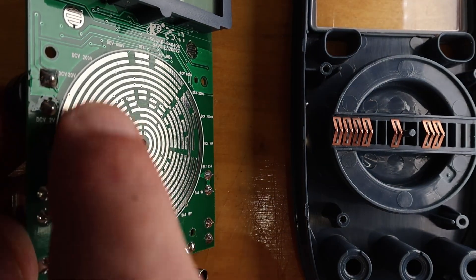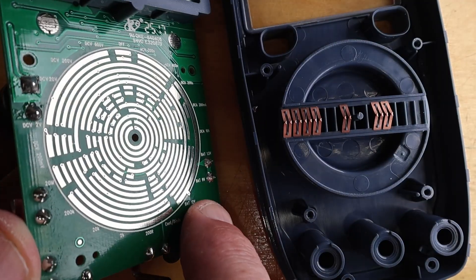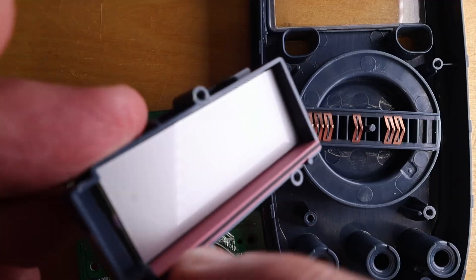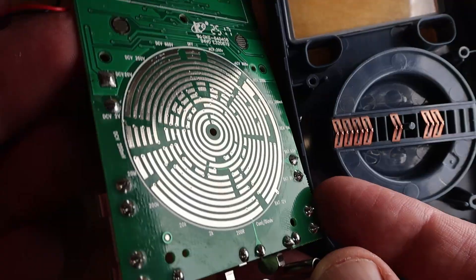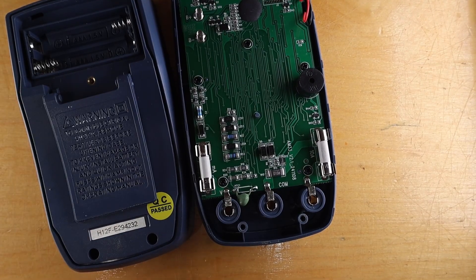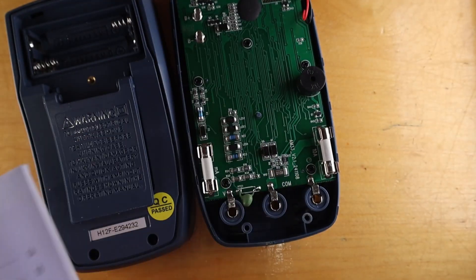On the other side of the board is the rotary switch pattern — a fairly complicated switch that moves across multiple positions at once. It has what's probably a nickel coating, not as robust as the hard gold plating you'd find in a more expensive meter. Over time this will wear down and the meter may eventually malfunction with heavy use — always trade-offs with price. The display is held on by a zebra strip. In terms of safety regulations — meeting national standards like UL, CSA, or TÜV — there's nothing here. The meter doesn't claim to meet any national standard and there's no CE marking even mentioned in the manual.